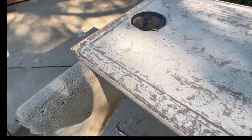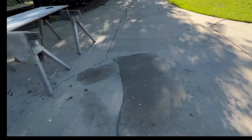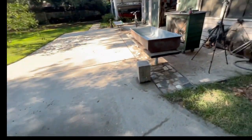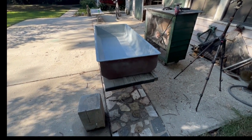With the flap wheel I've ground all the buildup right off the inside of this little lip, then ground the whole thing so I can put epoxy on it. I eased the corners on all of this so I won't bleed anymore. Setting the top on it — this little lip that's going to fit on the outside of that flange is going to make it super strong because the sides can't bow out because of that lip. Structurally I'm super happy.